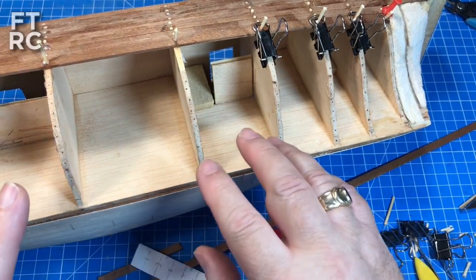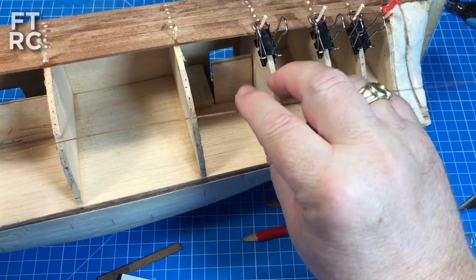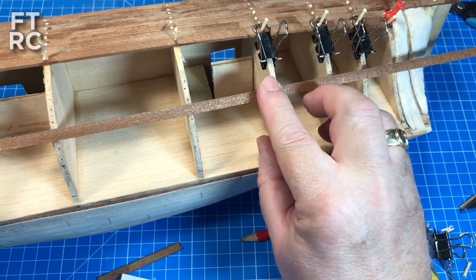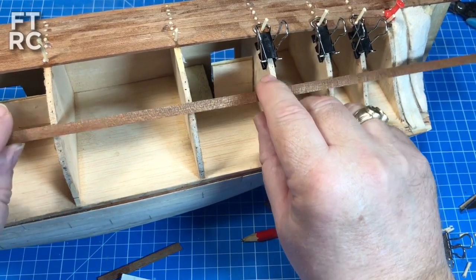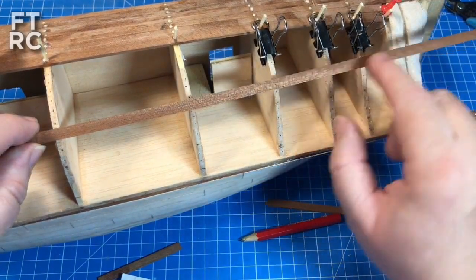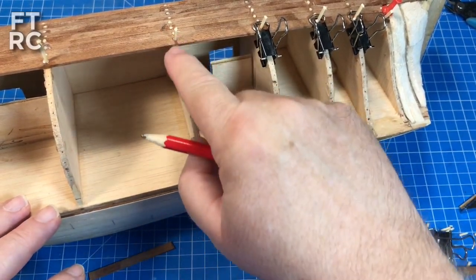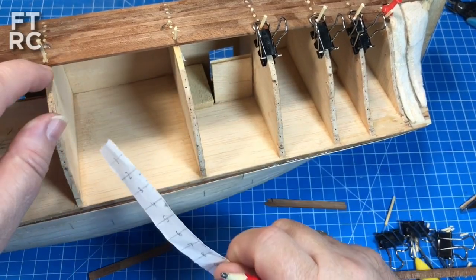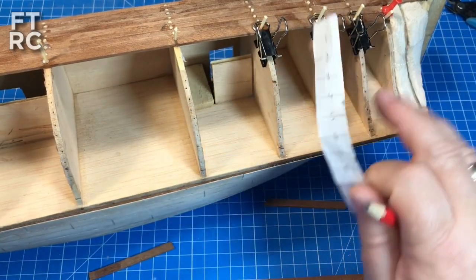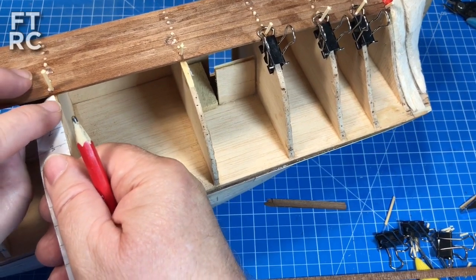All right, next thing we need to do is work out the tapering, because that's what this is all about. And this was all shown in the Marina Balcony video, we'll need to put on this plank, it's a thin one, but it allows us to show how it bends up. Even though we've got an even amount here, and there'll be 7 and 7, and they won't need to be tapered, as it goes out, the tapering changes. Now, it will be consistent for each region, so our two little regions are 7 millimeters.